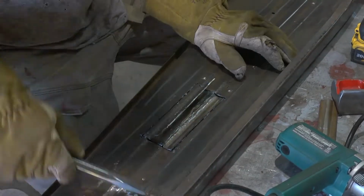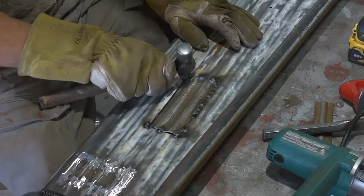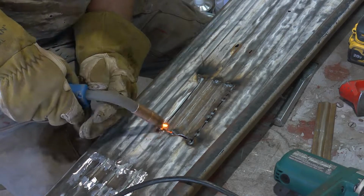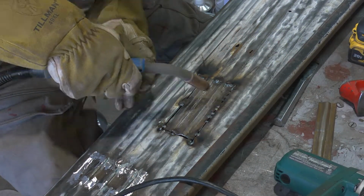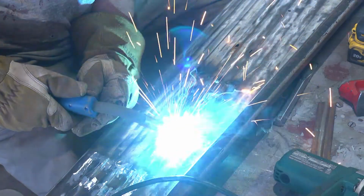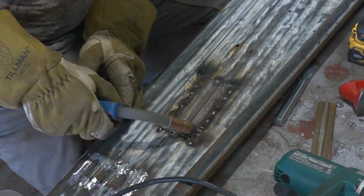perfectly in alignment. Now, another thing that Freezy talks about is do one spot at a time. Don't cut all the rust out until you have the final shape you want, and then replace it one at a time, because otherwise you end up with something really floppy, and it will be very difficult to get it straight once again after you've welded it up and twisted it out of shape, if you cut out all the areas you want to weld on before you're ready to actually do the welding.